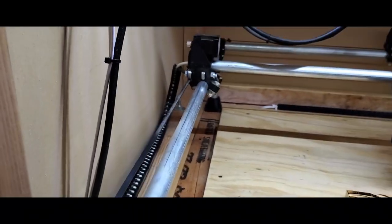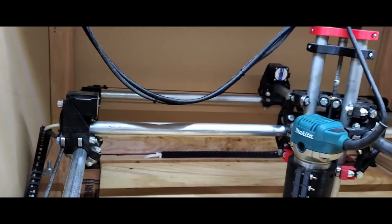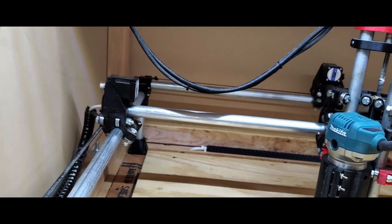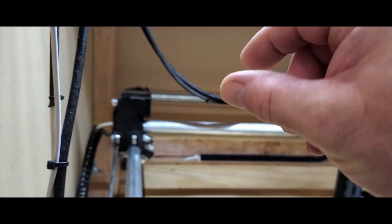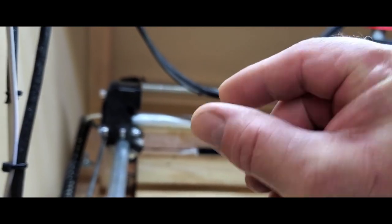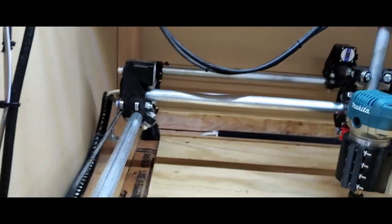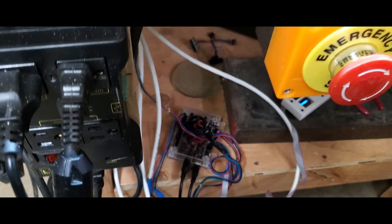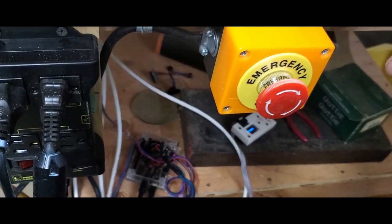And the problem that I had that I resolved is I went ahead and I disconnected the two zip ties on the two belts for my Y-axis that was grinding. I went in Candle and I ran it, and both the motors were kind of doing this back and forth just a little bit, kind of screwing up. They weren't constantly turning, and I found out that my connectors on my board down here, one of the pins on the DuPont connector wasn't in properly, and that was causing the whole problem.